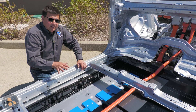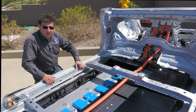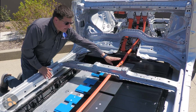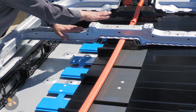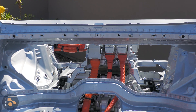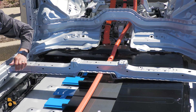That's possibly one of the reasons that this vehicle does not DC fast charge quite as quickly as some of the competition, because of the design of the cooling system in this car. From this angle, you can also see why so many EVs have a very minor hump — it's all because they want to protect these high-voltage cables. It's best if these are in this little cutaway area, in this sort of pseudo-tunnel that also adds a little bit of rigidity to the platform. If they had routed those cables somewhere else, they would be a little bit longer, heavier, more expensive, and not quite as protected as this central location.